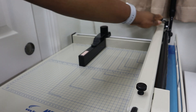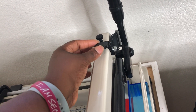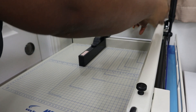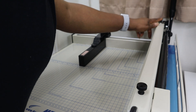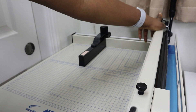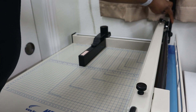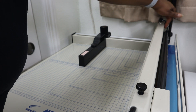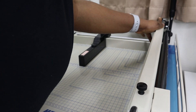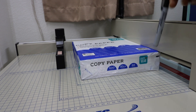When you are engaging the handlebar, there is a little lever here that acts as a safety lock. You have to press it down — that is what allows the lever to come down and engage the blade. Now if you put enough pressure on the handlebar without holding this lock down, I believe it is possible for this to eventually snap off, because this little black part is just welded on to the metal. So you want to be careful with that, because then you would lose the safety feature.